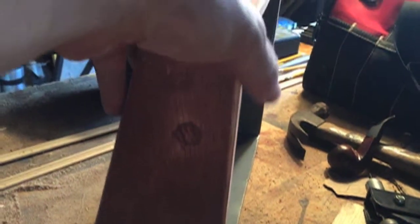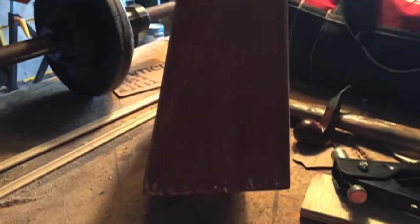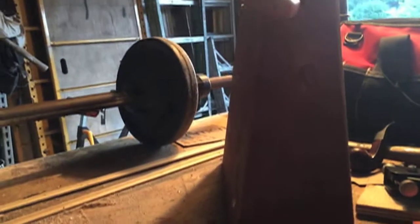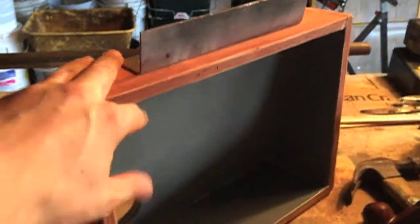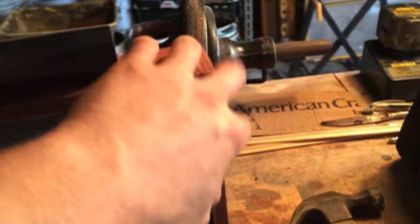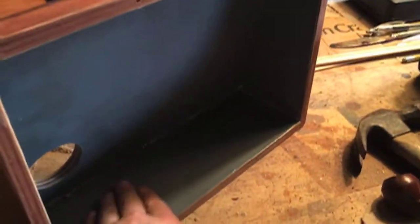This is the custom breaker box I'm making, and it's by far turning out to be the most complicated part of the job. I'm not dealing with 90-degree angles — I had to design this to fit the contour of the boat. I lined the inside of the box with sheet metal, so I have the wood finish on the outside for aesthetics and the safety of metal on the inside, sprayed with electrical-resistant insulating paint.